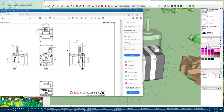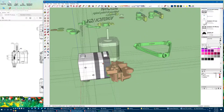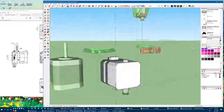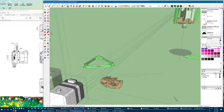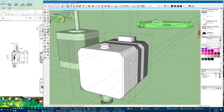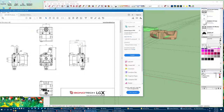My plan is to mount off of this and I might even stick some mini radiators on there if the heat's going to be a problem. Warm PLA does not play very well over the long term. If you're designing PLA parts for a printer and you want them to last, they need to be beefy. That doesn't necessarily mean using a lot of plastic — it means they need to be over-designed for the forces they will encounter. Good design can get you around the need to be super fat. One way to find out would just be to print two, and then if it breaks, quick switch to the backup and print something beefier. So this is ready to design around.